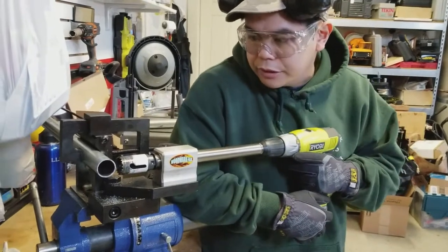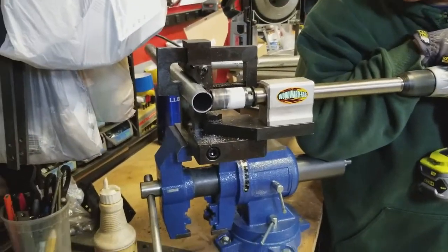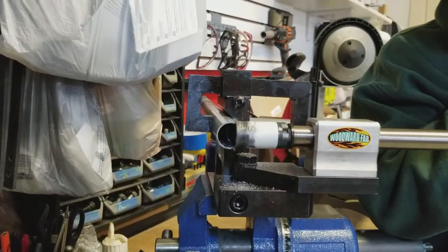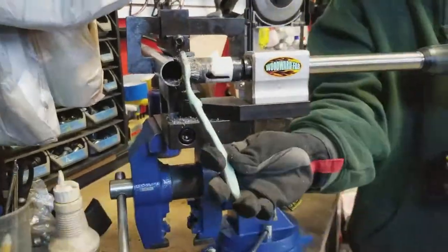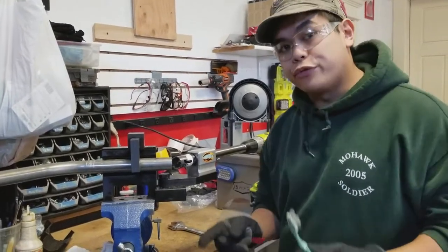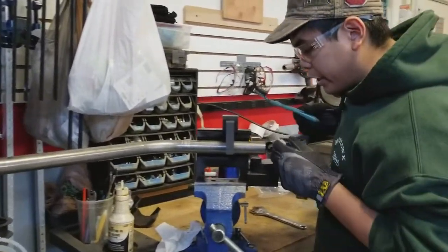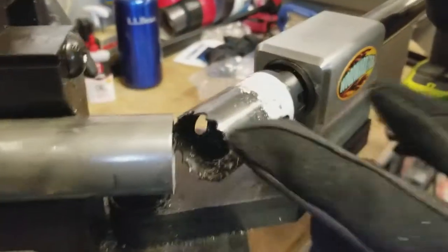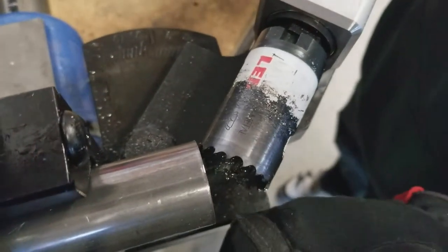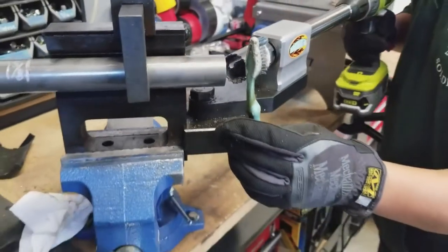So we cut the aft crossbar. We've done all the 90-degree cuts and we're starting with the 45 degrees. This is gonna be one of the outside pieces. This bit is a little long and we couldn't pull it all the way back to get a bite into the metal. So we're gonna start right over here — there's some really thick weld material, so we should be able to make up for any gap that we get in the piece. Right now I'm gonna just lubricate the bit and then start to cut.